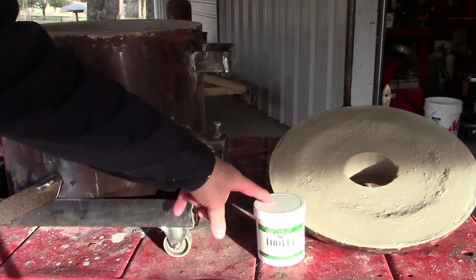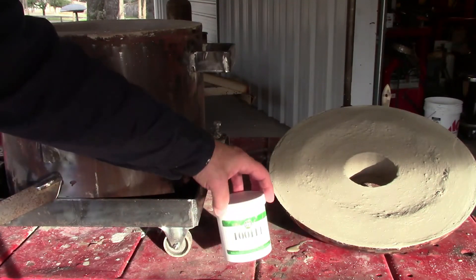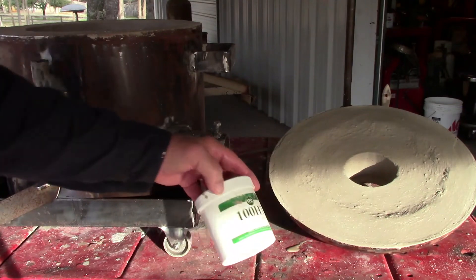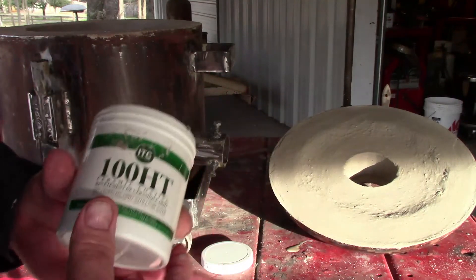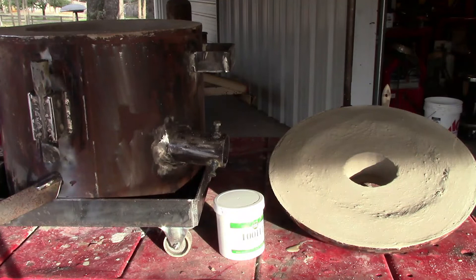This is the brand of ceramic refractory coating I got to put on that refractory cement. It's a clay-like material — you mix it with water and just paint it on with a brush. I put a good coat on there and I'm going to let it set up, then probably tomorrow I'll fire it up and let it cure to see what happens.